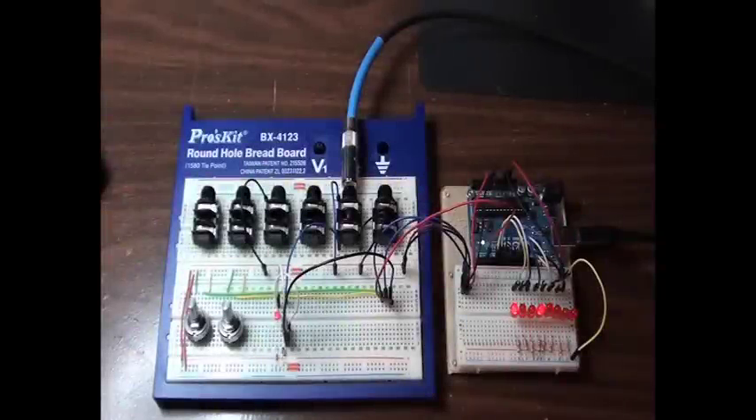Not everything has to be done with an ArdCore 001 module. In this case I've knocked together a quick version of the ArdCore system using an Arduino Uno, and I just made this breadboard full of jacks. I put a knob and I put a little conditioning on the clock input so that I could first of all see the clock running, and second of all make sure that whatever my modular system is punching out, we're okay.